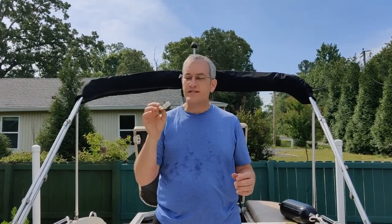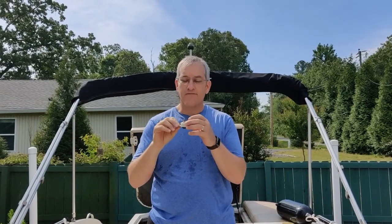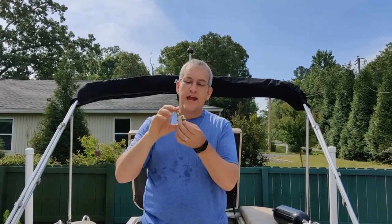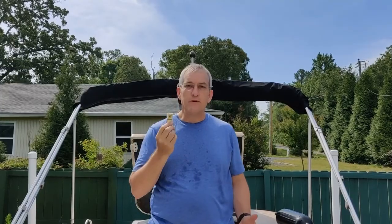You see another guy on the internet talking about replacing a 90 amp fuse to fix his boat but he could never show you where the 90 amp fuse was. You just had a preview of where it's at — this is your 90 amp fuse. This will cost 30 to 50 dollars. I don't know what caused ours to trip, but this is the problem and we're going to change it out, and then we'll see how our no crank, no start situation goes from there.